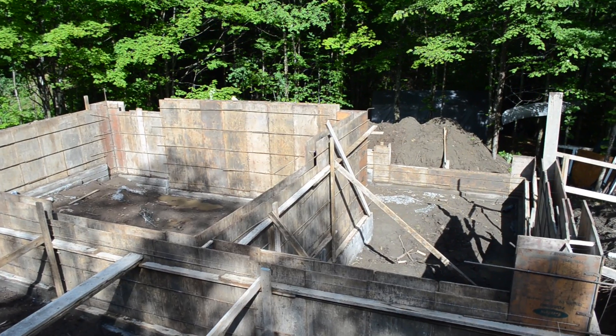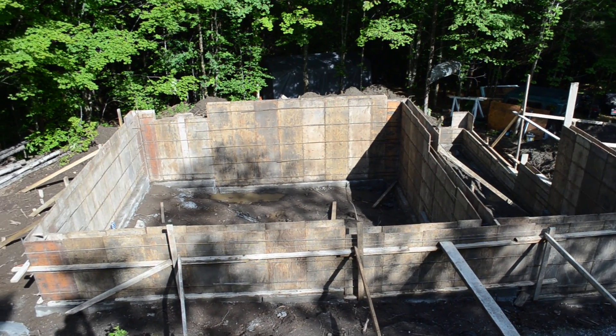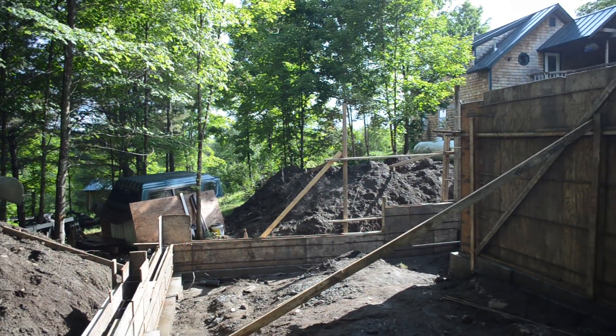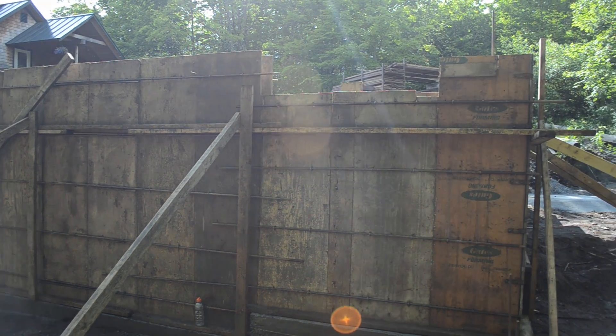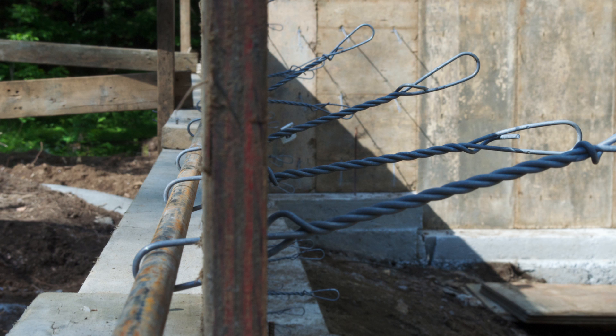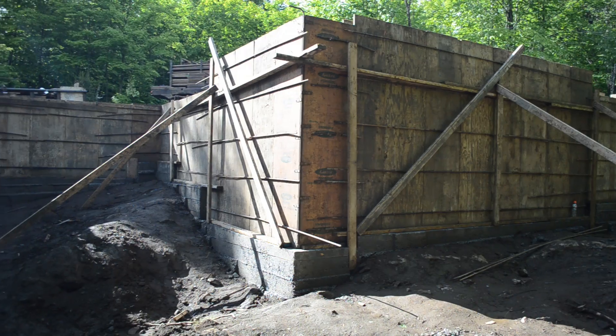Most of the forms were level at the top, but obviously they didn't have enough to do all of them level. For the pour day, I think they spray the inside with a release agent, and I think they may have done that this day as well. The basic process for the forming: there are rods on the outside of these forms — you can see a bunch of them here. Those go through metal hooks, and the metal hooks span the form and go out on the other side, with a metal rod over there. That way they can pull out the rod and take off the form, which actually keeps the forms together laterally so that when the concrete goes in they don't actually bulge out. It looks like they're about every 16 inches on the way up, and that keeps the forms rock solid. Check out the next video — they're actually going to be pouring these things.